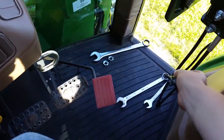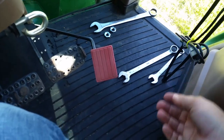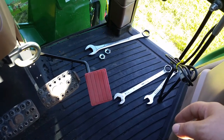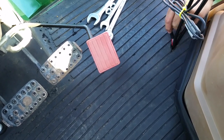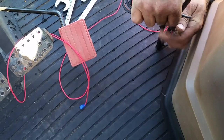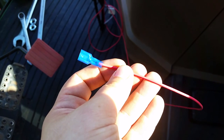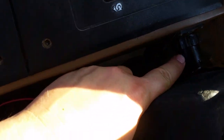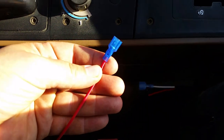The next step is installing the wiring harness. The joystick comes with a short pigtail and a plug that plugs into the wiring harness. The wiring harness itself goes down through the same hole in the floor as the cables and then attaches to the electric parts of the valve. The red wire goes to the power source in the tractor, supplying power to the electric third function. A standard plug is included in the kit — if your tractor has a matching plug, this attaches directly and you've got your power source connected. If not, you'll need to snip the end off and direct wire it to the power source.